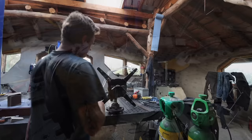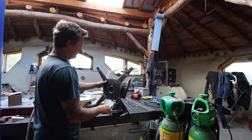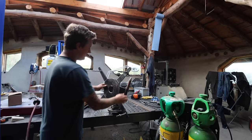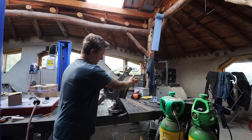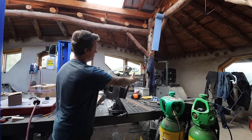Hey everyone, it's a new day. We're getting somewhere with the wind turbine now. It's rotating around on its bearing. It's got its offset angle, so when the wind hits, it's trying to turn it out of the wind. The tail, which is offset at an angle here, keeps it in line, so the forces on the tail keep it straight. The wind's constantly trying to push it around its axis like that, but the tail keeps it straight, until the wind gets too powerful and the tail can't hold it, and it will rotate out of the wind and the tail will come to the side and it furls.